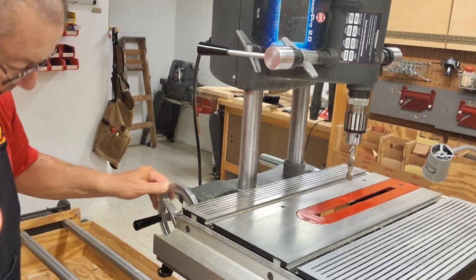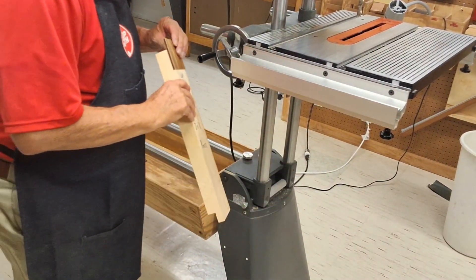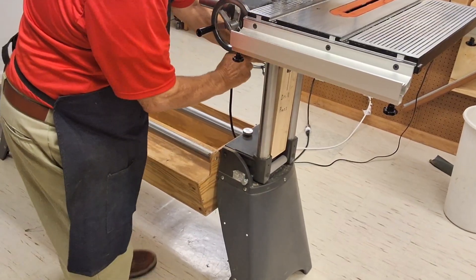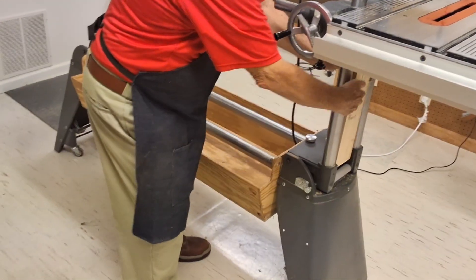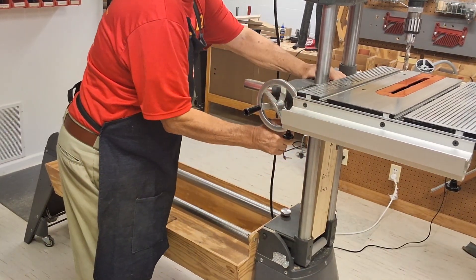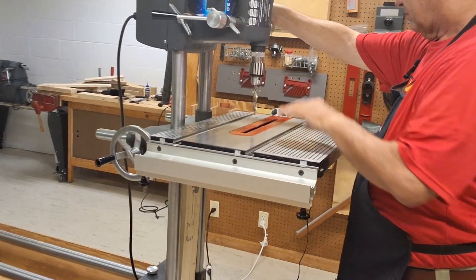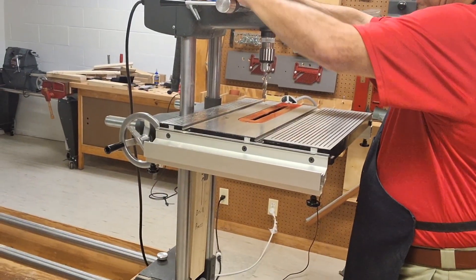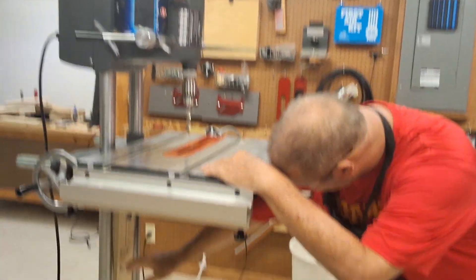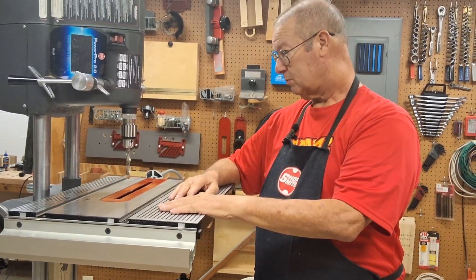You can see that the support is here to support the table. Now — it fell. So that's the next step we have to do before we finalize this, because I want to make sure — I'm going to release the carriage lock and let the table actually wait and fall right down on it. Now it's not going to fall out. And now I will lock my carriage lock. So that keeps the table from slipping down when we're pushing down on it. Sometimes if you're doing mortising actions or other, that table could tend to slip. And so that's why we put this in here. But really the best reason to have it here is so it keeps this right at mid-chest level, which is the perfect height for you. And that's what we did when we calculated the length on it.